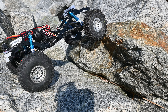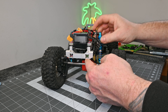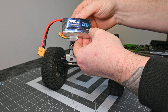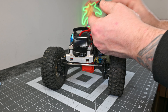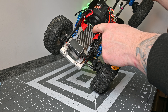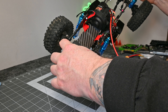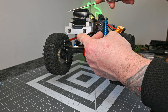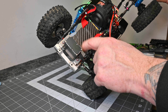I played around with different battery placements and realized I can definitely fit it in here. I have a resin printer — this print kind of messed up at the bottom, but there's the battery: just a 1500 milliamp 120C battery, great little batteries. What comes with the kit is a carbon plate and I sort of lobbed it off here and made a plate that goes around the servo. The servo goes on the original mount, the plate goes on top, I added some stainless screws and alloy washers to hold everything down, and then the carbon plate mounts to the 3D printed part.